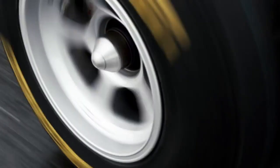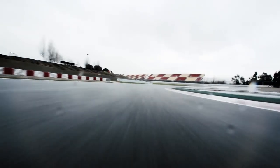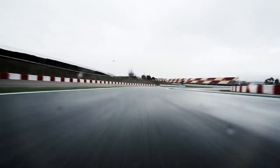However, conditions such as the weather, the state of the tyres, the consistent behaviour of the driver, they're things that are changing. However small, they're changing. However subtly, they're changing all the time. So track testing is the most realistic way of testing, but it's also the least repeatable because of these changing conditions. And track testing also wears out the powertrain, wears out the tyres, and so costs much more than other research methods. Model testing costs less.